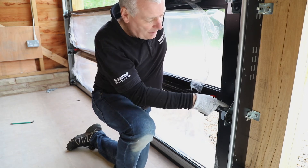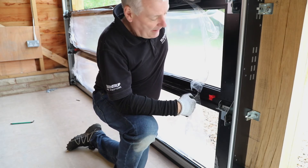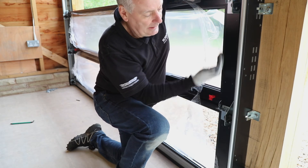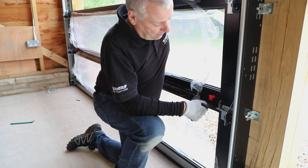Do you remember we talked about getting the barrels of the hinges in the same place? Pointless doing all of that if we then have one person putting the panel higher at one end or lower, and we get a load of binding and crackling and horrible noises.